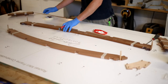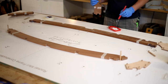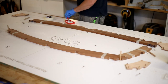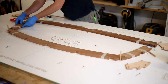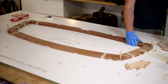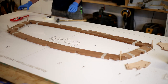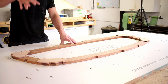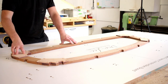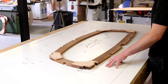I've also found a slightly better technique for gluing up. What I found works better is to pull the bottom two dowels out of the frame construction board. That enables you to slide the side sections up into the deck beam and then slide the floor up into the side sections, which compresses the glue much better into the frame. This is opposed to sliding the sides down from the top, which has a tendency to scrape the glue off the joint as you press them in.